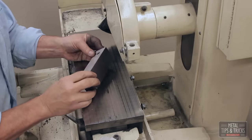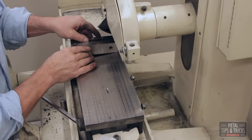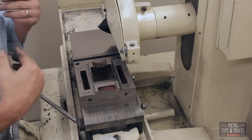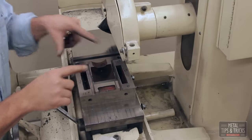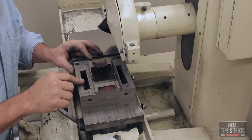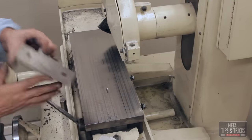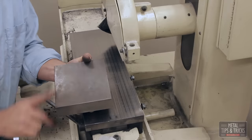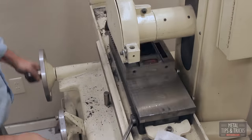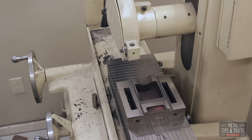We now have two of the sides parallel and perpendicular to this surface. Next we put the fixed jaw down and put them together so when I grind these, they grind at the same time. They may never match up — there's almost a ten thousandths difference between them. So we're not going to worry about grinding that one at this point. We'll just grind on this one, get it flat and parallel to the top here, and then start working on getting these ends squared out.